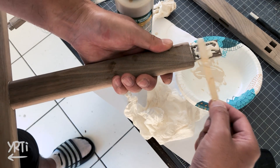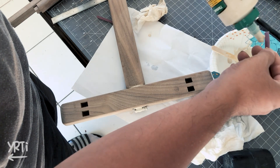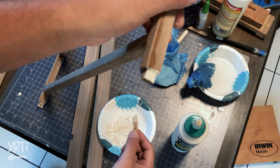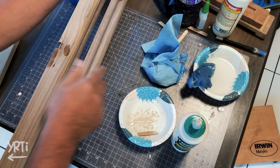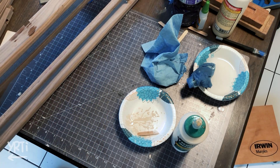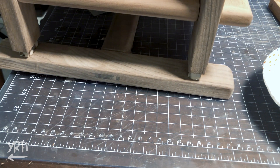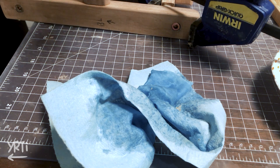Finally, I can assemble all the pieces. I started with the base of the legs where I did the wedge joints. This is where people most likely won't pay attention to, so I used a purple heart wedge on purpose — hopefully someone's gonna find it someday. Now the side panel. I thought it was easy, but it seems like I put too much glue, and it took a long time to clean the excess after assembly. So please don't use too much glue, especially when the joints are already tight. Then I put the side panel onto the base — when dry fitting I could fit everything okay, but it didn't go in now. I guess somehow somewhere is slightly dislocated by glue. But I managed to push them in with a clamp.